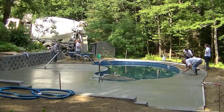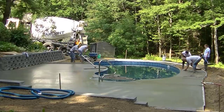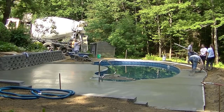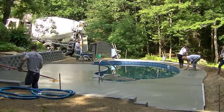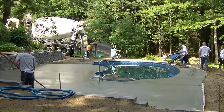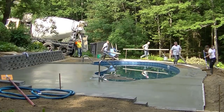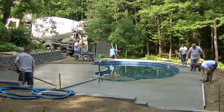We're getting down where the wheelbarrowing is pretty fast now — just one wheelbarrow — so we don't need two guys wheeling; they'd just get in each other's way. Luke jumped back and he's helping me now, magging that four-foot section out. He'll use a little short screed. Since they've got that under control, I'm going to go back and cut in some more joints just to try to stay ahead of the game.